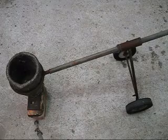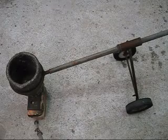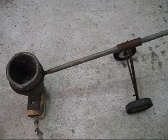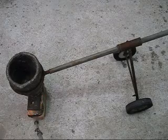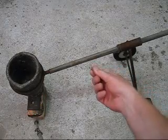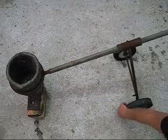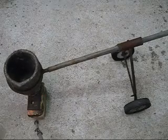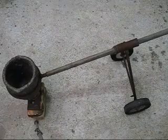When using the pouring trolley, always pour a mould and then move backwards and pour the next mould. The reason for that is if you spill any iron and it gets under the wheel, it can jam the works up. I will show you what happens when I put a little screw underneath the wheel — see what happens, it jams it up.